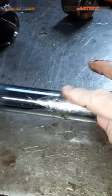So what are you doing now? First, we're going to lubricate the rod, thoroughly. And now more lubricant again. I think you're a little too liberal with that. Hang on. You want to roll it on and try not to damage it. So that's the gland nut on. You need to put it that far.